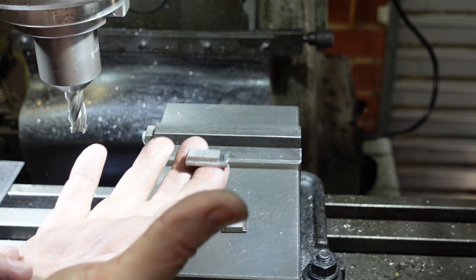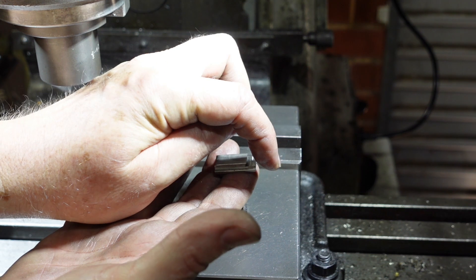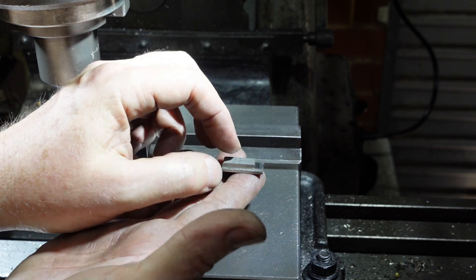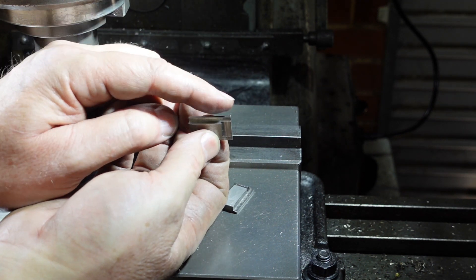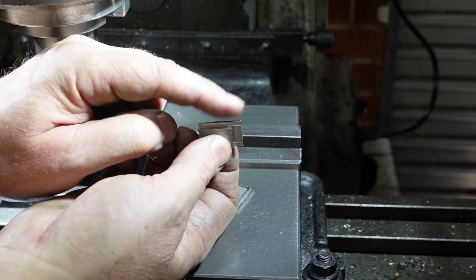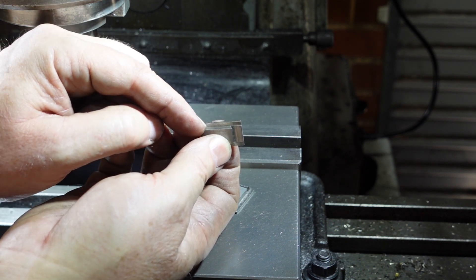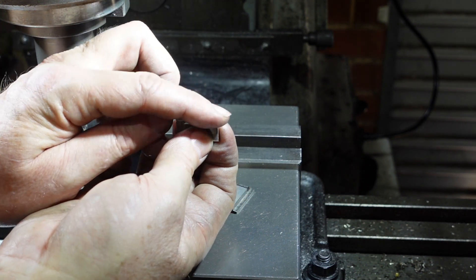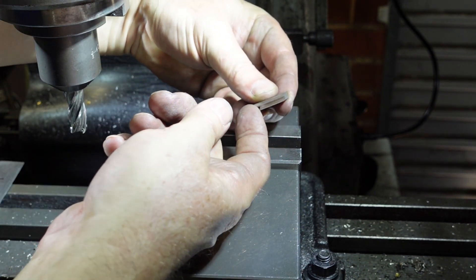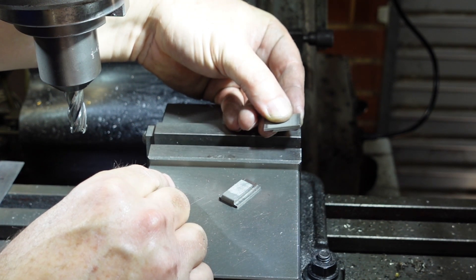For people trying to do this themselves, the way I did that was: before I put these recesses in, I came along, trimmed off the front edge, came in with the dovetail cutter and put the dovetail in, then put them up on their side on a parallel. I had to machine that down — take 0.2mm off — the drawings aren't nominal, so I had to make sure it fitted, and then I came down about 2.6mm I think, then flipped it over and did the other side. I'm now going to clamp that in the vise using the sides to support it and take it back to the 19mm length I want rather than the 25mm it is at the moment.